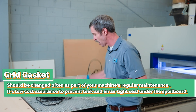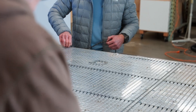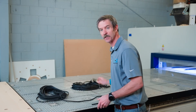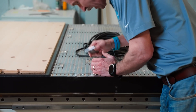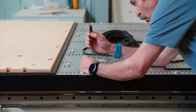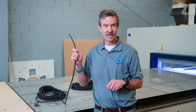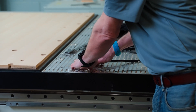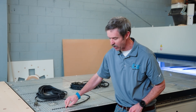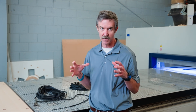What we do is cut our square gasket material to the exact size of the machine you have, whatever that channel dimension is. In this case we're measuring a quarter by quarter channel — a quarter of an inch wide and quarter of an inch deep. With this machine, a quarter by five-sixteenths gasket fills the width of the channel evenly and sticks above by a sixteenth of an inch. That's the proper concept to have a seal all the way around — consistent, flat, square, airtight — trying to get that airtight mentality into the machine itself to eventually make it to the parts.